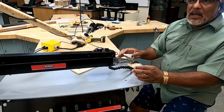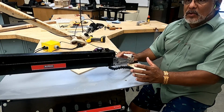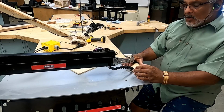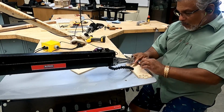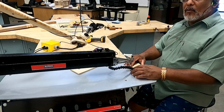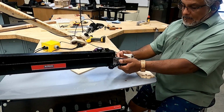Anything can happen in any place in this building, and you have to be aware of what's going on, what you're close to, the machine that you're operating. You never want to look away. So here's the deal. If I'm operating this machine and I'm looking down at where my hands are, and someone calls my name, now I don't know where my hands are, right? I can move my hand right into the path of the blade, and then I got myself, okay?